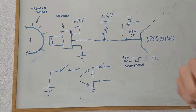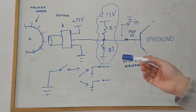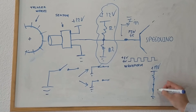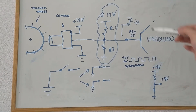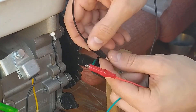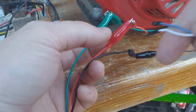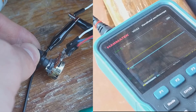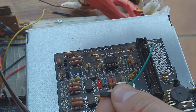How I am actually going to do it: I'll use a potentiometer. With this setup I can use the potentiometer as a voltage divider and adjust it to output five volts. Now let's translate those drawings into an actual circuit. As I explained on the whiteboard, I am connecting the potentiometer in order to adjust the output voltage of the sensor. I lined up the sensor with the wheel until the output was high, then tweaked the potentiometer until the output reached the desired voltage. This way I was sure I could safely connect the sensor to the board.